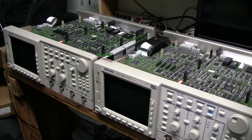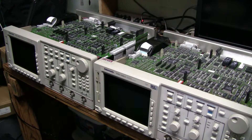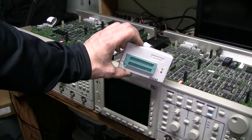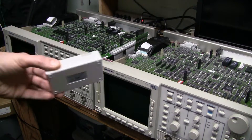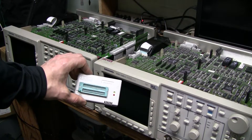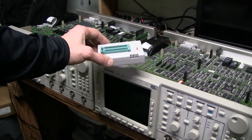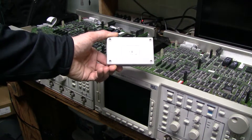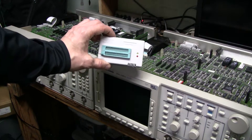In the repair video I showed how I made a backup from this NVRAM chip, which is a Dallas DS1650Y. I used this programmer for that purpose, which is the TL866CS. This programmer does not support the DS1650Y, but it supports the DS1250Y, and I said in the video that I read somewhere that the chip can be treated as a DS1250Y.